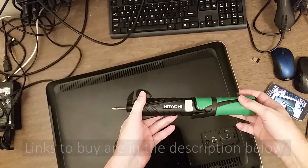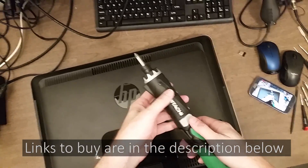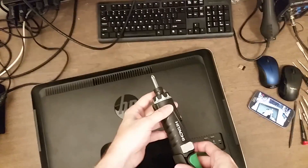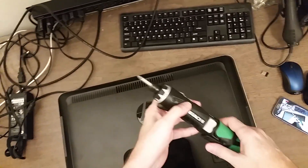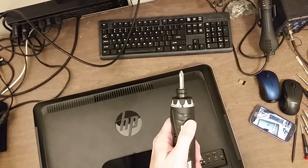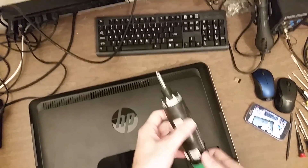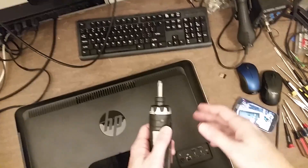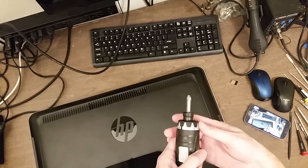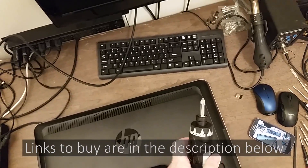About this screwdriver — this is a Hitachi. I'll put a link to it in the description of the video. It's battery-powered and comes with two batteries and a charger so you can swap them out. The rotation speed is awesome. Ordinarily to get a rotation speed this fast, you'd need one of the really large ones with the ridiculous battery sticking out. This one also has a clutch where you can set it to tighten to a certain degree. Right now I've got it on number one, the least powerful option. When tightening down a screw, instead of stripping the thread or breaking the plastic, it will just spin and not apply more force. You rotate it to a higher number for more tightening and loosening force. Very nice — sixty bucks.